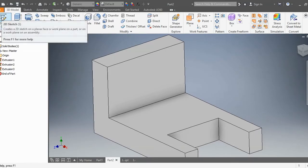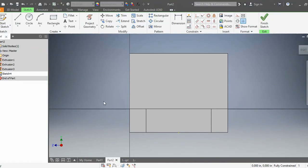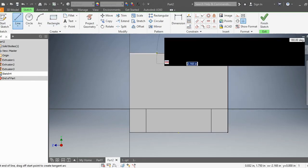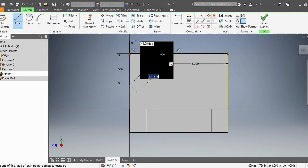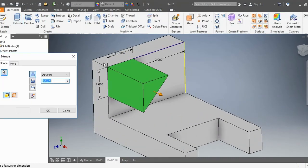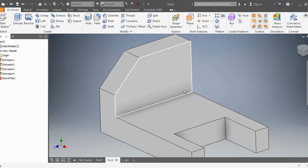Now I'm going to start a sketch on this front surface here. I'm going to go 2 inches from the right hand side, 1 inch in, then 1 inch down. And I'm going to go ahead and connect that here — so I have built a triangle over here at this corner. I'm going to finish that sketch, then extrude and cut. Press OK. So that builds that.